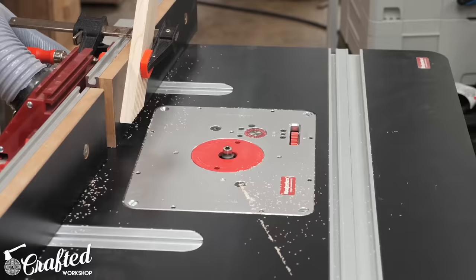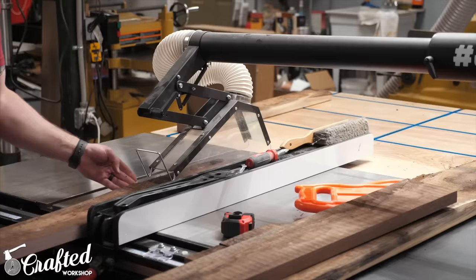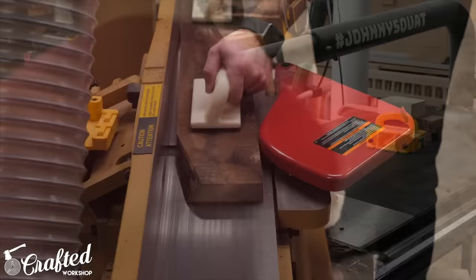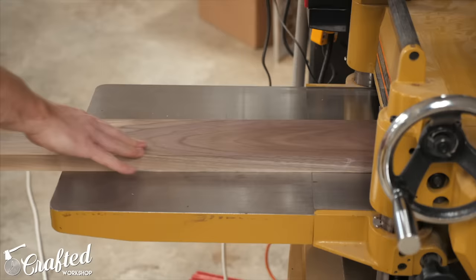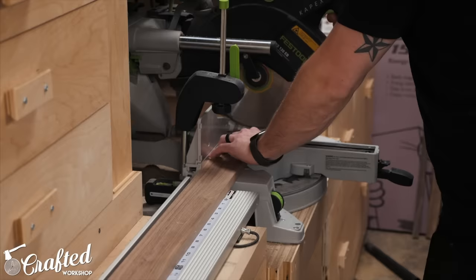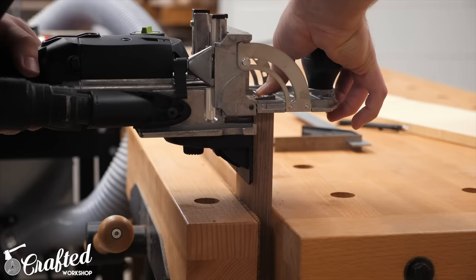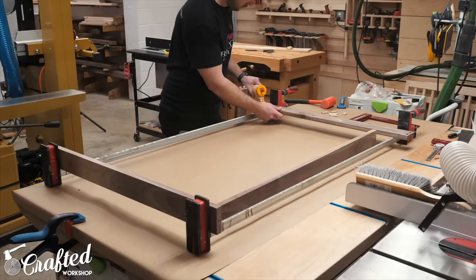With the sides basically done, I could move on to the leg structures. They're an open, kind of rectangular design that wraps around the ends of the sides — it's a really cool look. I decided to make the legs out of walnut to get a nice contrast from the maple. First I broke down the rough walnut into pieces, then flattened them on the jointer and planer. After flattening, I ripped the pieces to final width at the table saw and then cut them to their final length at the miter saw. For the joinery I used two dominoes per corner on the legs, which provided plenty of strength. I just used glue and dominoes, wiped away any squeeze-out, and clamped everything together.